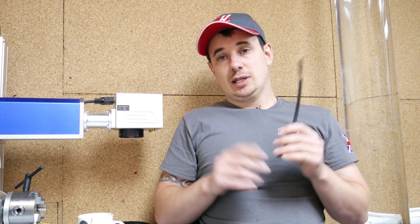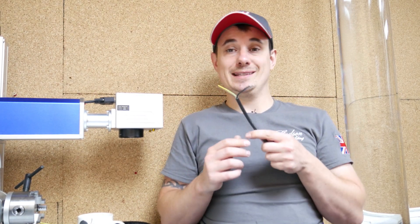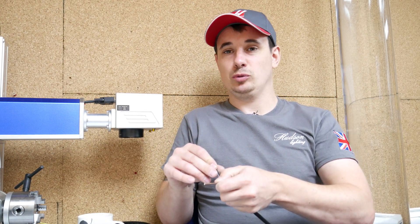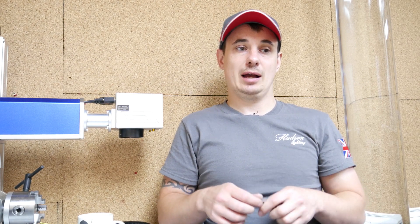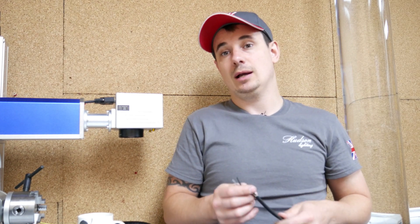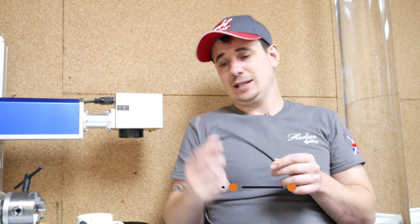This is the cable I recommend most for extra low voltage installations. I always recommend a four-core 0.75mm for lights. The reasoning is: run two cores out to feed five or six lights, and leave the two spare cores in case your client wants to add more lights later. With constant current lighting there's a maximum limit on the LED driver, so to add more fittings you need more cables — having two spare cores already in the run solves that. More often than not, you just run a four-core anyway to feed the additional lights.